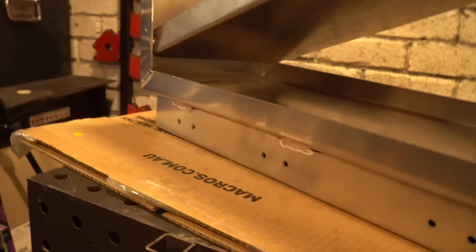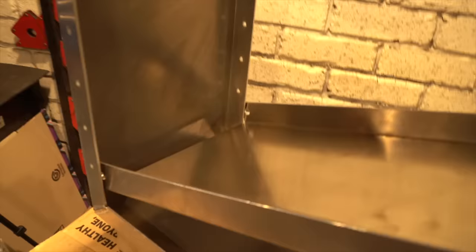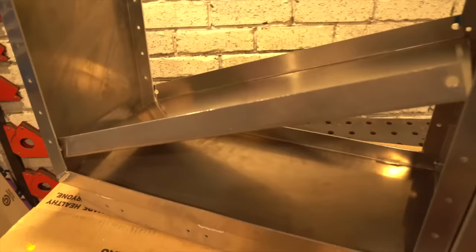Pantry almost together. The last thing I had to do was bolt up these shelves, which should have been really easy — just whack your nuts in there. But unfortunately they didn't fit in this width. I checked all my drawings in CAD and gave them 2mm tolerance, which I thought would be enough. I actually stuffed up the fold on this one, so I'll have to recut and refold another one off camera.